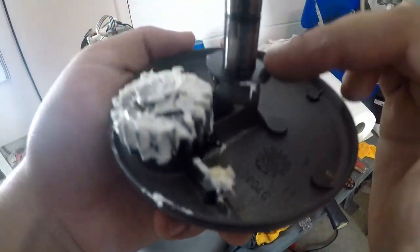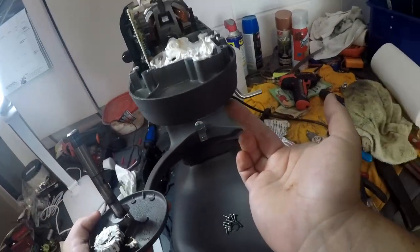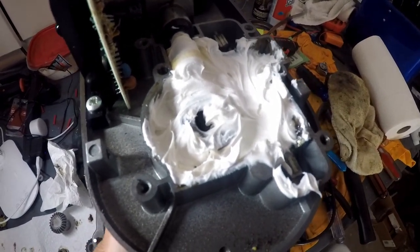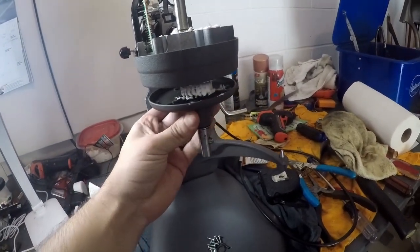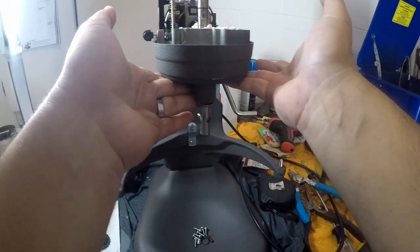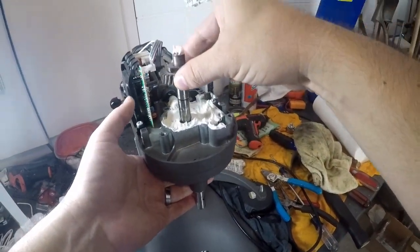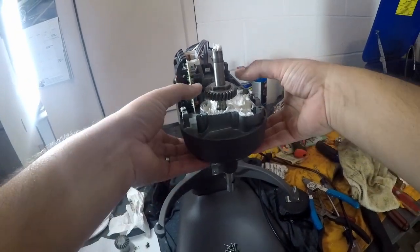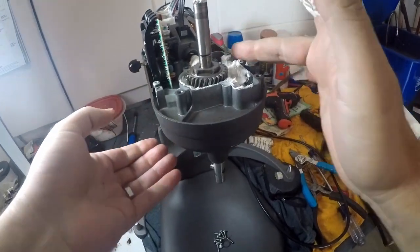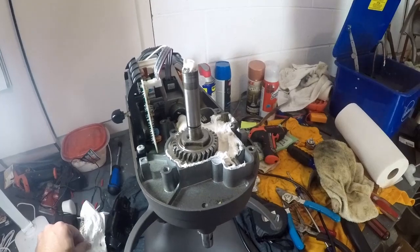This gear will actually just slide right back up into the planetary. Make sure your little washers are there — sometimes they will stick up where the gear actually came out of, on a little ring it sits on. So if you don't see it on here, that's likely where it is. Rotate it a little bit until it gets in line — you'll see it kind of pop up into there. Now we can go ahead and put our first gear back on — this is the worm follower gear. Put it right over the top, grab it with both sides, and with your thumbs press it down into place. Sometimes this can be a little bit of a task — it can be a little tight. If you want to lube this shaft up, it'll help it slide better. If it's really tight, you can take your rubber mallet and just barely tap on it.